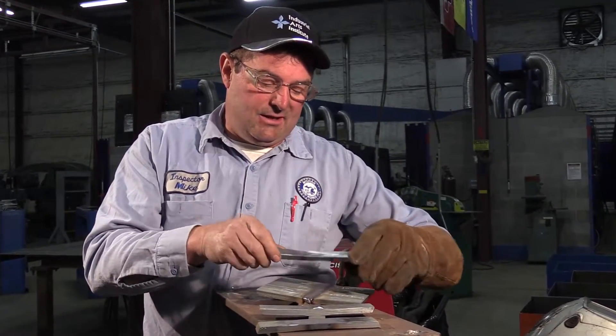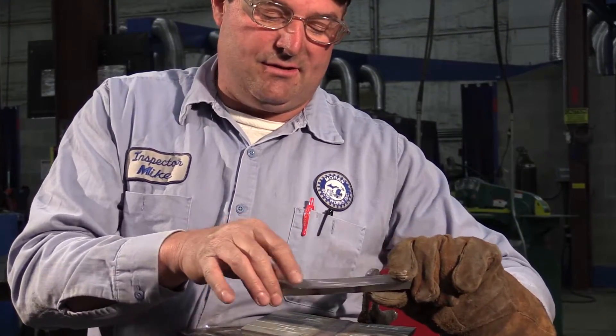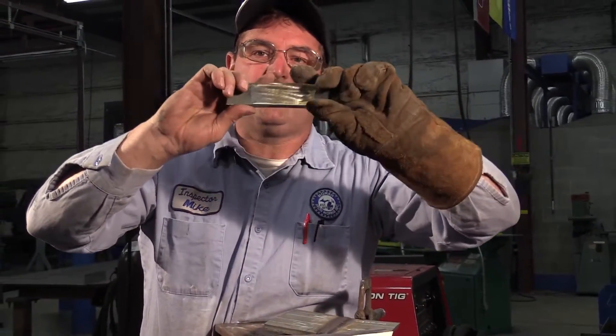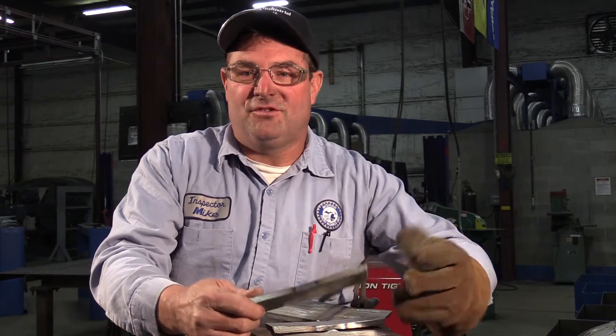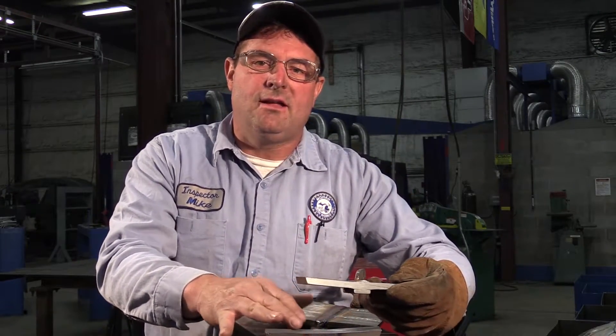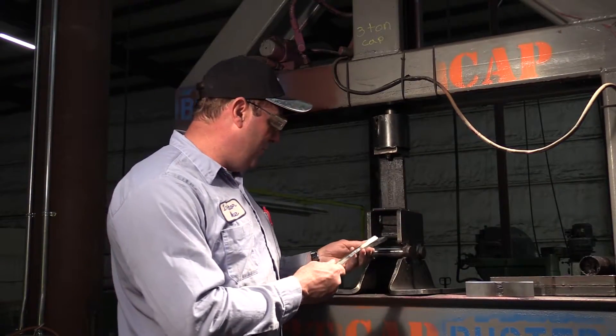The other specimen is the opposite — I did the same prep but this time I sanded off the face, cut off the backing bar, and prepped the face to do a face bend. This one I bend this way; the other is the same but I bend it up — that's why I have it prepared upside down. Root bends are 80-plus percent of the failures that come from bend tests. The middle one I haven't prepped at all — that's just a backup. If there's an issue or question about what happened, I can use that center one as well. I didn't weld these, so we'll see what happens. No promises on pass or fail — we'll go to the bender now. Root bend, face bend — we'll put them in the bender and see what happens. All the bender really does is stretch them, and if there's a flaw, a void, or trapped slag, it's going to rip or break.